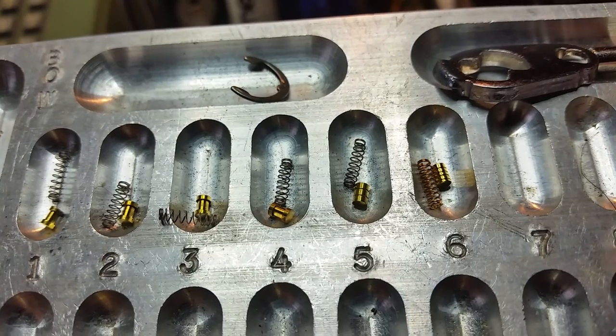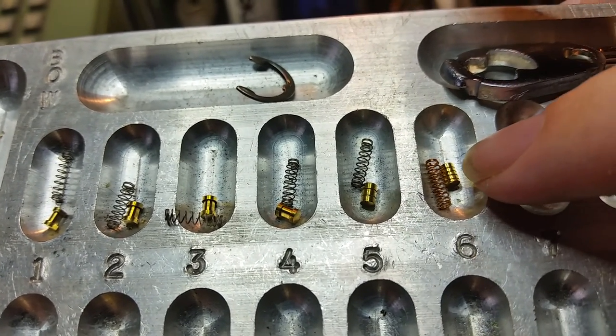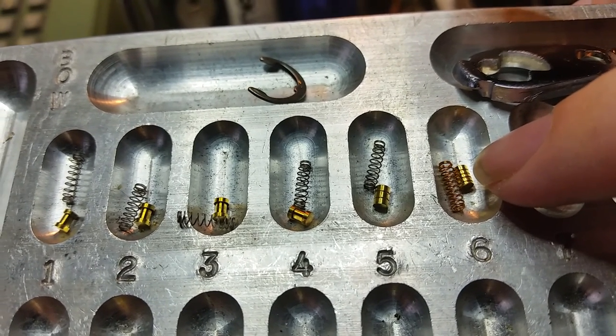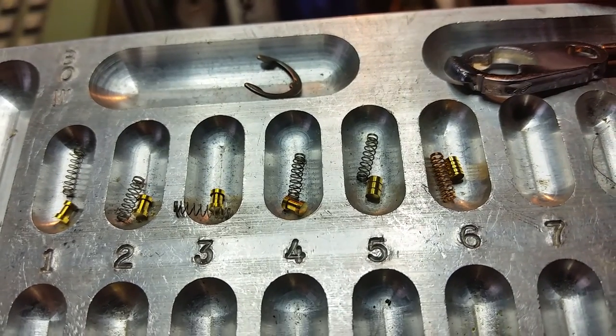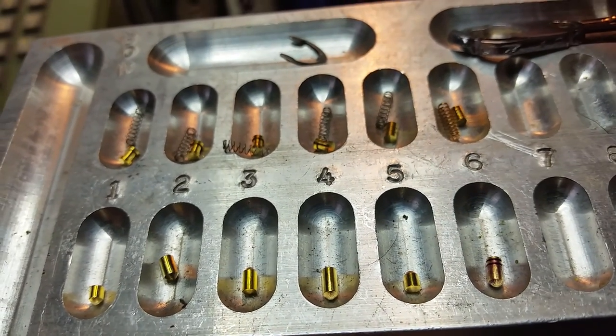It's only got 2 very shallow serrations, and they're very widely spaced compared to the American serrated pin, where we've got, what, looks like 5 or so cuts in there, and they're very tightly spaced, which does a much better job of tripping you up. So, that's about it for the Master Lock 911.